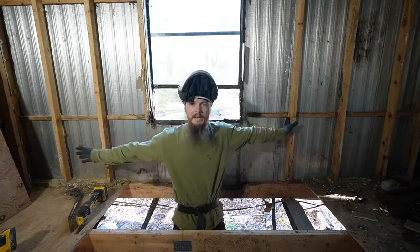We made it more work than it needed to be because we didn't come prepared with all the tools that we needed. I really had to pound that first joist in, that sister. The reason is because it's a little bit thicker than the old wood for some reason. Tiny bit. I don't think in this unlevel old mobile home we're ever going to notice that little hump in the floor. It's fine. It just meant extra work for us getting it installed.